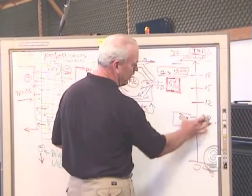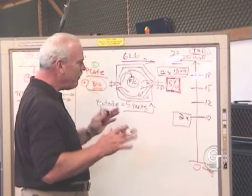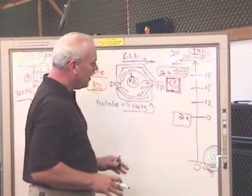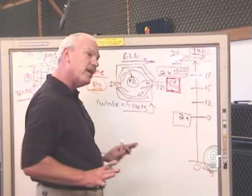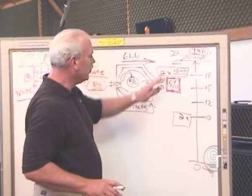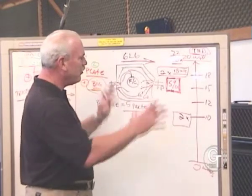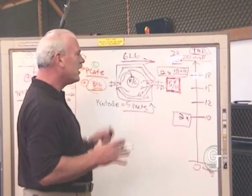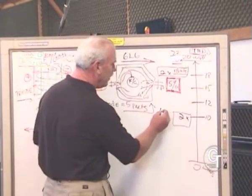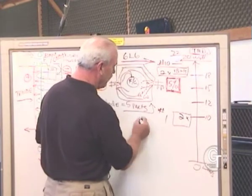We plugged a pair of tubes into a 50-watt amp and immediately heard differences from the stock tubes. Tubes that started generating characteristic distortion at half power sounded soft and easy, pushing distortion early. A pair up here with more headroom for distortion had a more dynamic characteristic — cleaner, brighter, tighter. So not only did we have matched tubes, which improved everything, we also had tubes with predictable characteristics, giving us the ability to create our 1-to-10 rating scale.